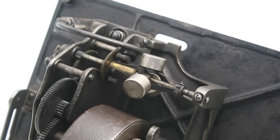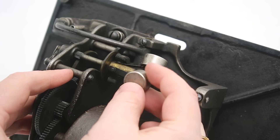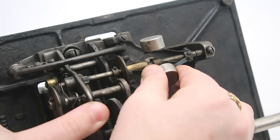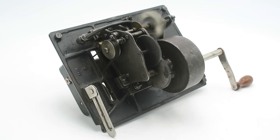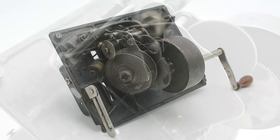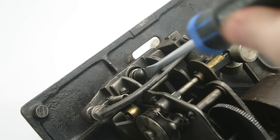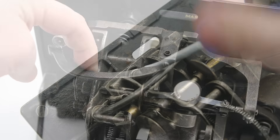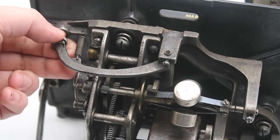The heart of the mechanism is the Edison governor, which allows the motor to spin at a constant speed despite the spring tension continuously winding down. It has three weights mounted on leaf springs, thrown outward by centrifugal force as the shaft spins, pulling a metal plate against a felt brake pad — the faster the shaft rotates, the greater the friction, slowing the motor. On the left side is the gear train transmitting spring force to the drive pulley. A small tension pulley adjusted by a screw determines how far the motor assembly sinks, tensioning the belt via gravity.